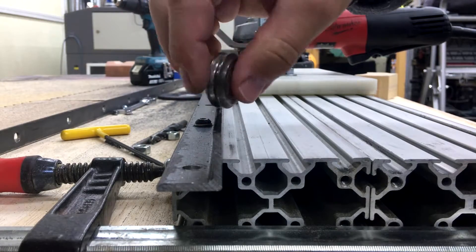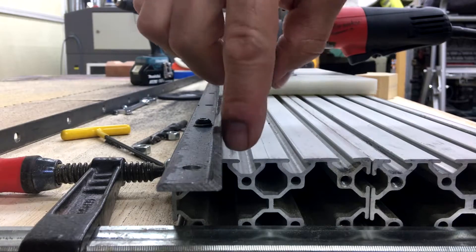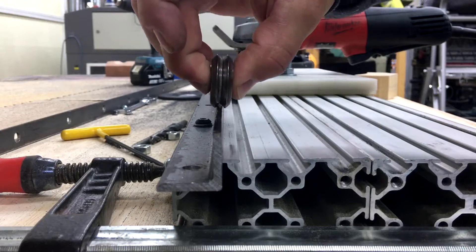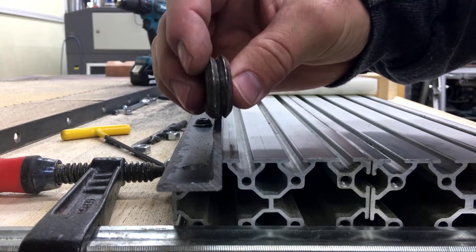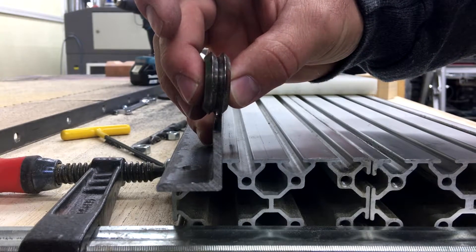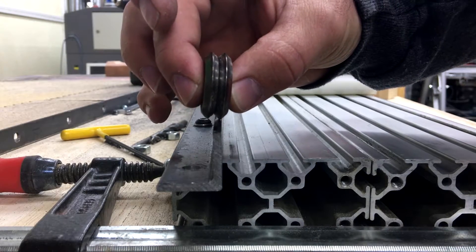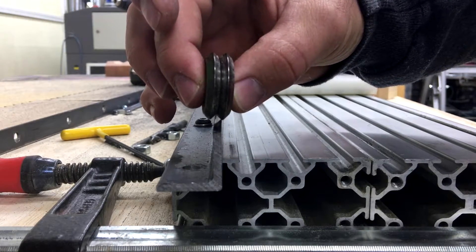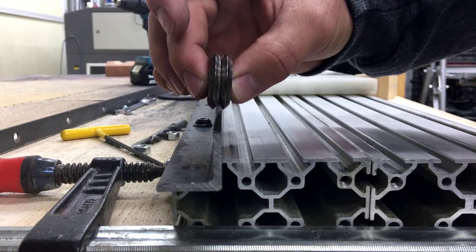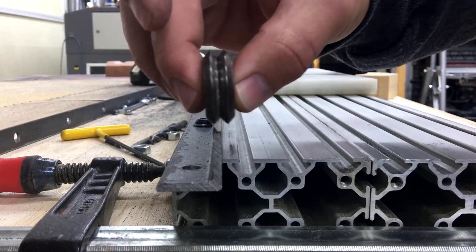It's almost like it's melting it and pushing it out. When you ride on that, it's going to get bumpy, so knock that off. Eventually you're going to have a nice fluid motion. When you put this back on your gantry, you've got to make sure that this V-bearing rides directly in the middle. If you don't have them lined up when you start shaping the rails, you're going to get a weird off-center, and that's going to create major problems — really bad bumpiness going down, because it just keeps eating the metal away.